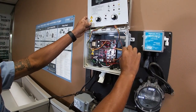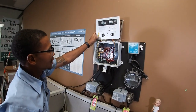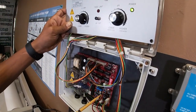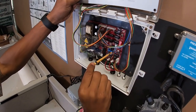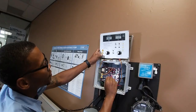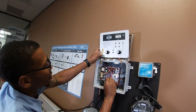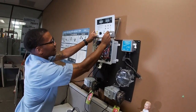Always when you're calibrating, you want to turn that off by putting number 4 dip switch to the left. Once you do that, go into VR17. If the pH feed light is on, you want to go clockwise just until the feed light turns off. You'll notice the pH readout is going to change as well. Now you're at about 7.5 — that's your midway point.